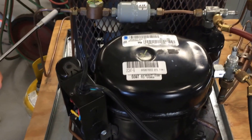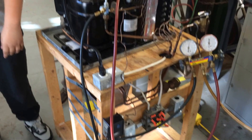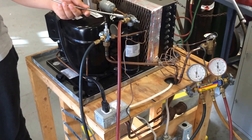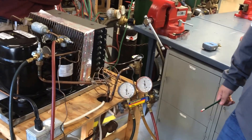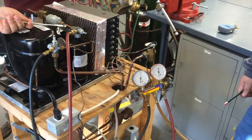We still have that flare — it probably needs to be redone. Go through and then we're going to pinpoint the leaks with soap bubbles. All this stuff could be on a test someday. Pinpoint the leak with soap bubbles, clear it out, and find all the leaks. Once you find the leaks, we'll fix them, and then this charge of nitrogen and refrigerant mixture can be blown out. The only time you can really blow out any refrigerant is when they consider it a de minimis release.